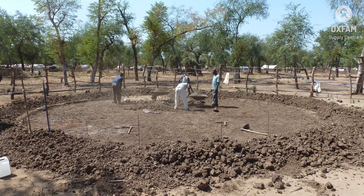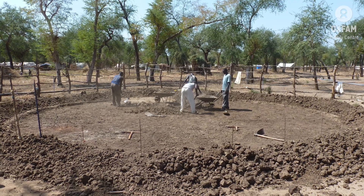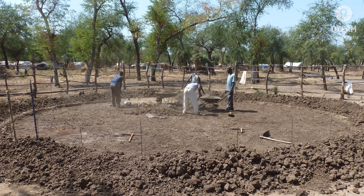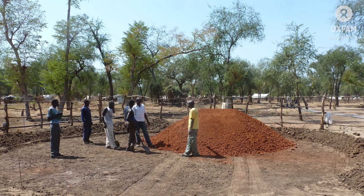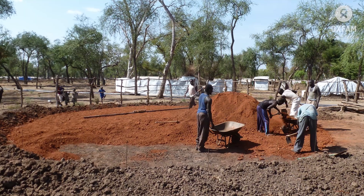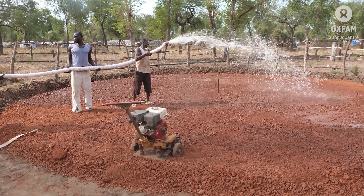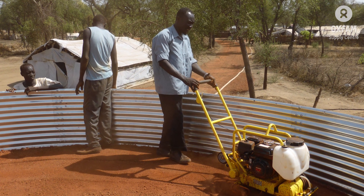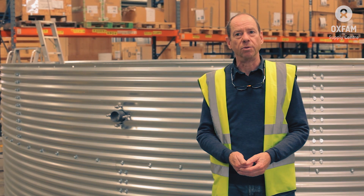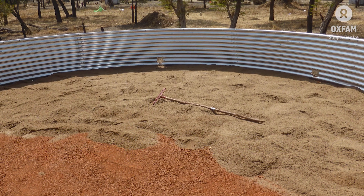If you're not able to prepare a concrete pad, you're going to be working on open ground with your locally available materials. In this case you're going to have to remove the vegetation and any roots, dig out some topsoil, and then start to prepare a similar pad using murrum or laterite. You're going to build this up in layers, compacting it at about 10 centimeter intervals. If possible, use a vibrating wacker plate to compact each layer of material. If this isn't available, make some hand tamper tools, but you have to tamp this down very carefully. Build it up to the right height and then finish it with a layer of sieved sand about five centimeters deep.